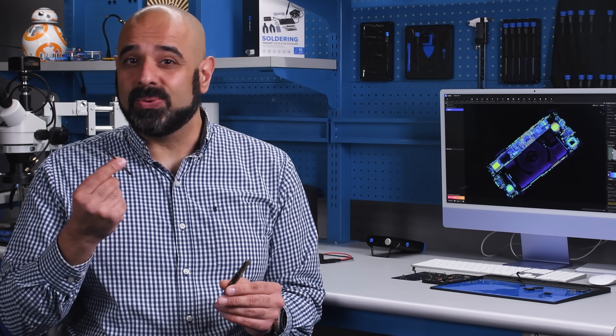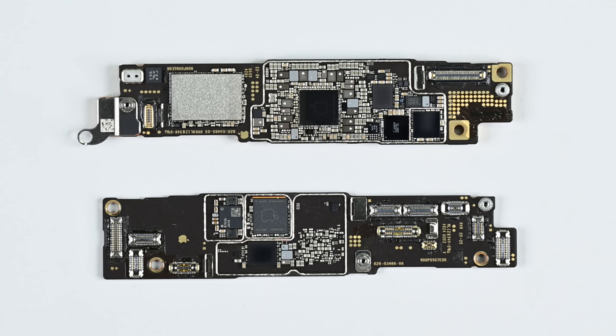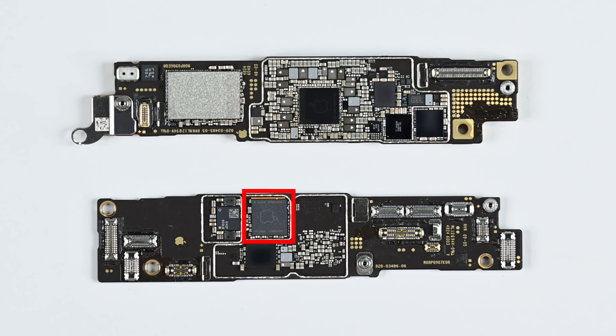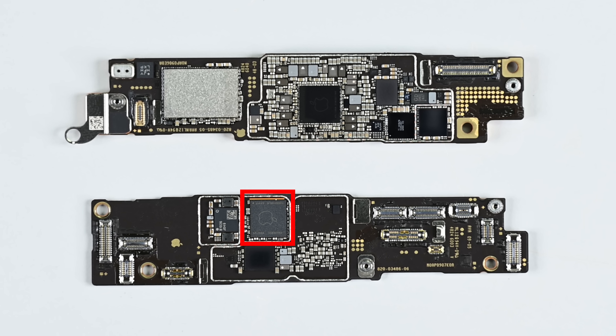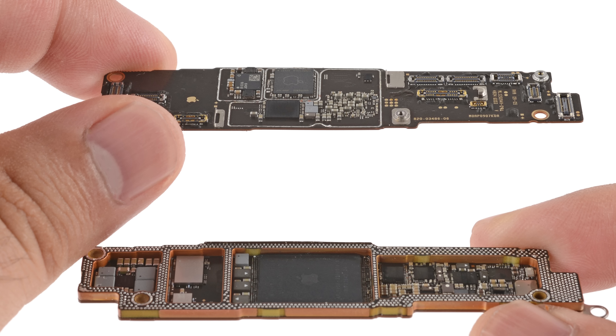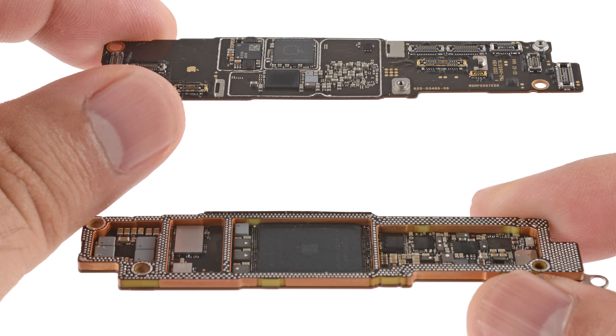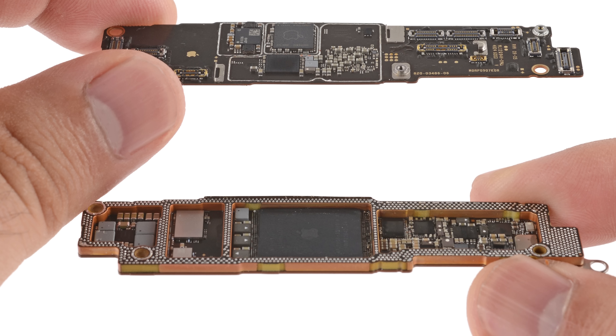Now let's take a closer look at Apple's new in-house C1 modem. It's located on the underside of the RF board, and our friends over at Yole Group were able to decap the chip and show us what's inside. The die shot reveals that Apple's new C1 subsystem replaces Qualcomm's SDX71M modem entirely, but maintains the same package structure of integrating the 4nm modem with DRAM. Interestingly, the 7nm transceivers are not located in the same package as the modem. Keep an eye out for our chip ID as we identify the location of all the major changes on the logic board.